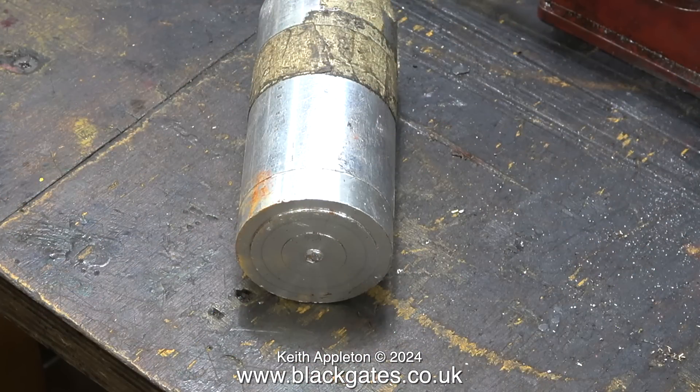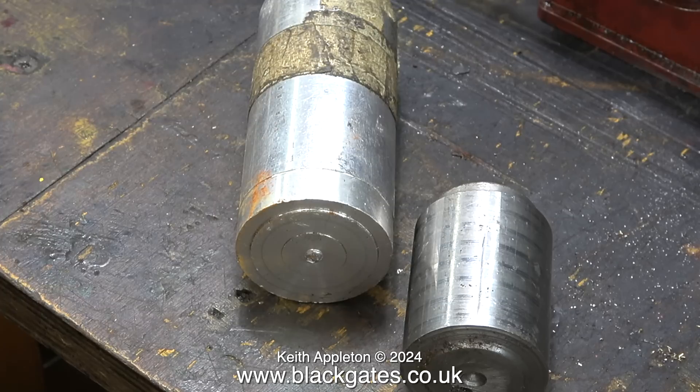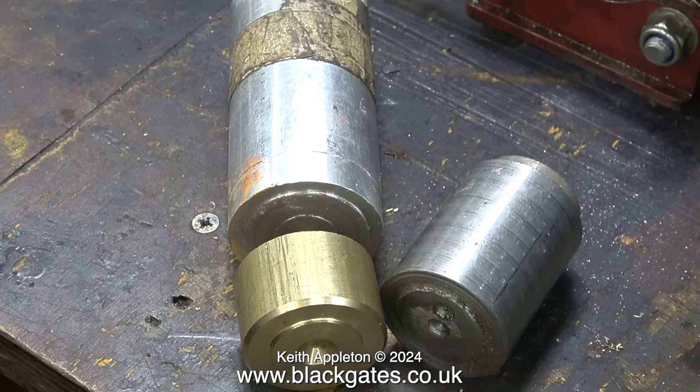You can't use just any old piece of metal to make pistons. This is a piece of aluminium which is unsuitable for a couple of reasons — one being the coefficient of linear expansion. Aluminium expands more than cast iron, and electrolytic corrosion could also be a problem. This is a piece of stainless steel and I could make the pistons using it, but it's really not worth the effort. Cast iron is slightly better because it will tolerate a lack of lubrication for a limited period only.